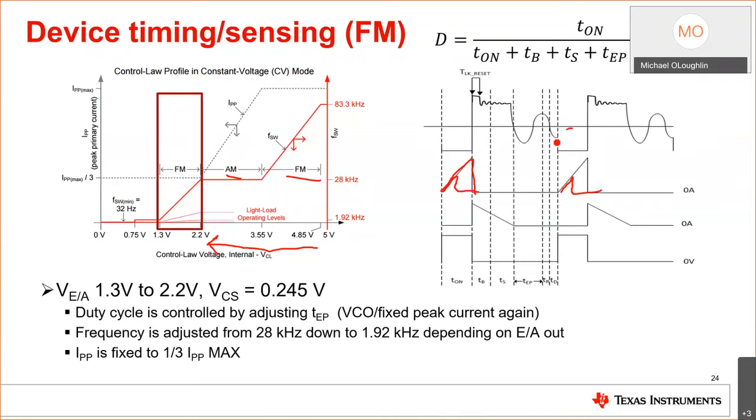This part of the circuit remains the same. As we need less and less duty cycle, we increase the delays and increase the ringing and turn on at a valley. Pardon me, because I'm writing with my mouse, if it's not too legible.